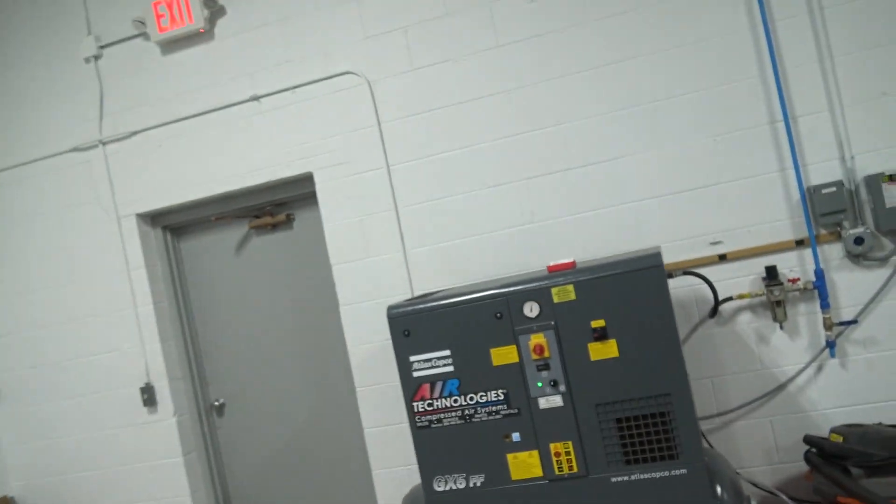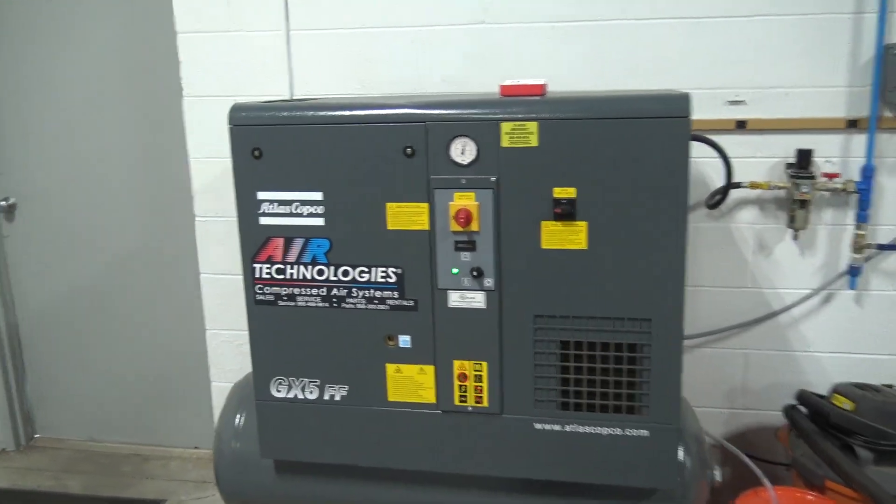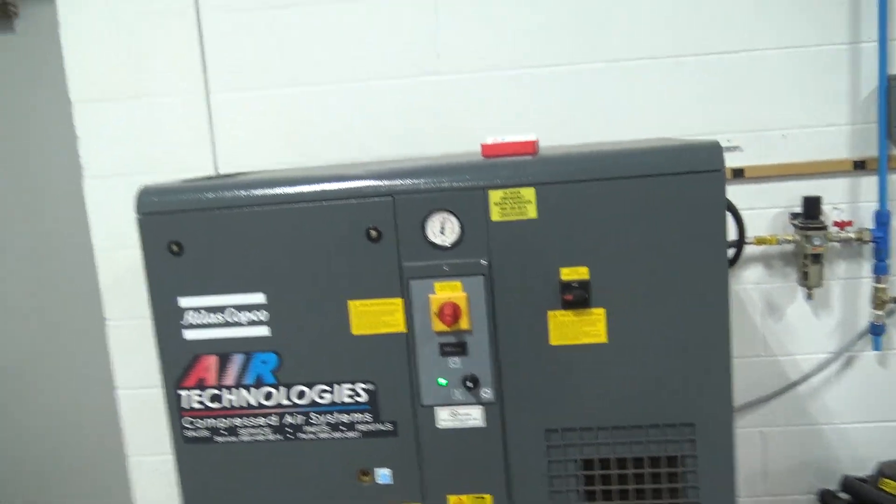I thought ours was going to come with a computer and it didn't. That's probably the one thing I was a little bit frustrated about. I know the next unit size up can or should come with a computer. And why does that matter? It goes back to one of the more complicated things with screw compressors, which is that they want to either be on all the time or off a bunch — they don't do well coming on and then coming off.